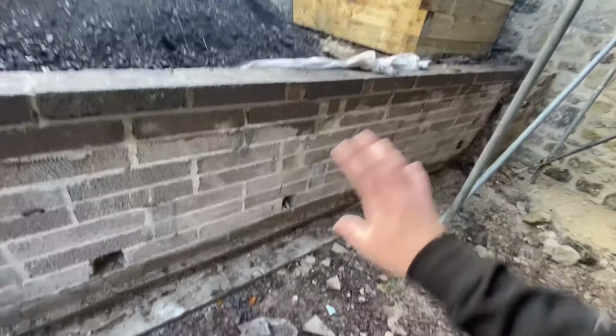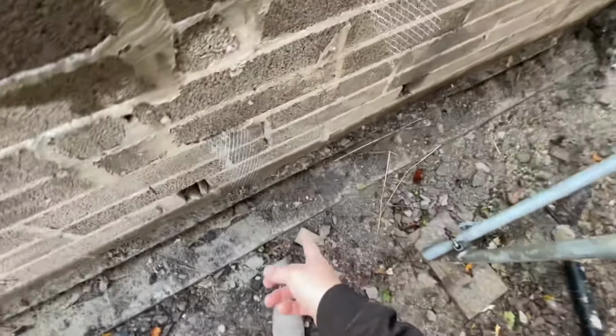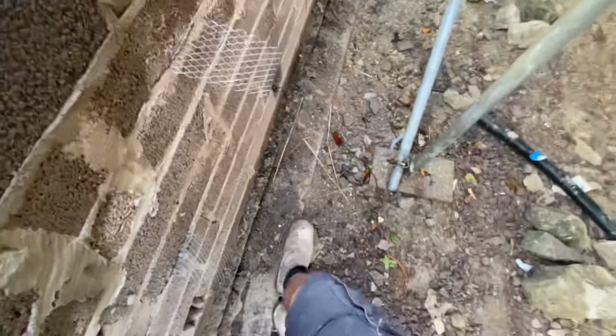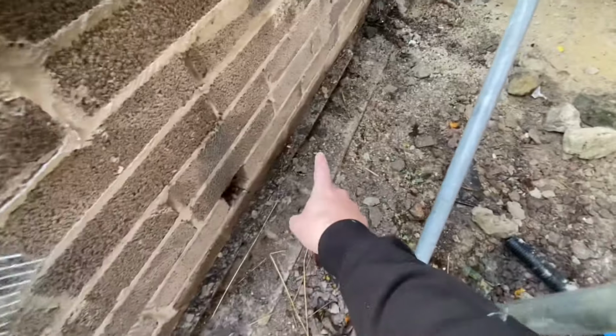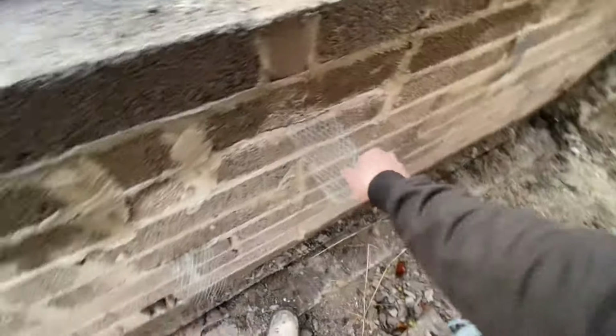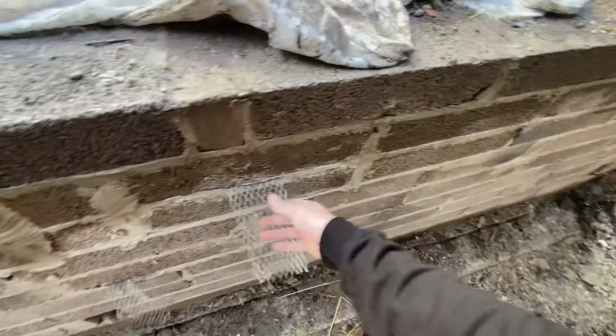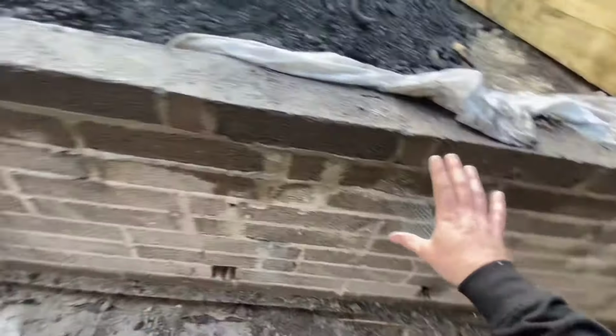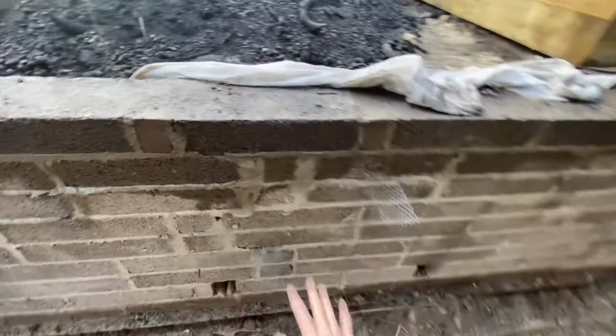Yeah, cladding onto this wall. It's already prepped. This is the width, so it's nice and simple. Got a block there because I think it's going to be underground from that point. All the ties are in. Got this coil ties stuff, works quite well, and there's loads of it. It's everywhere. So we're going to clad onto what I've done there all the way along, just to this block height for the minute.